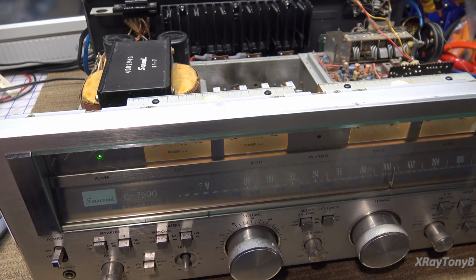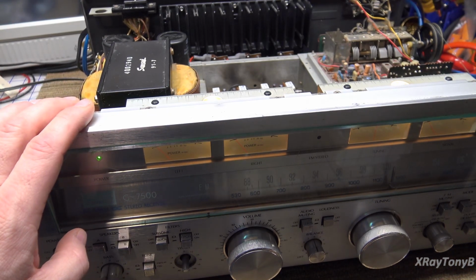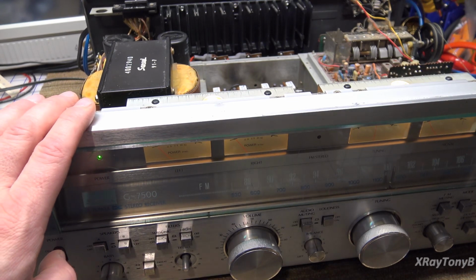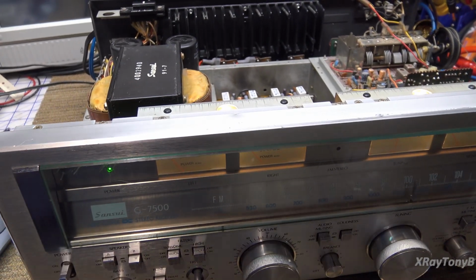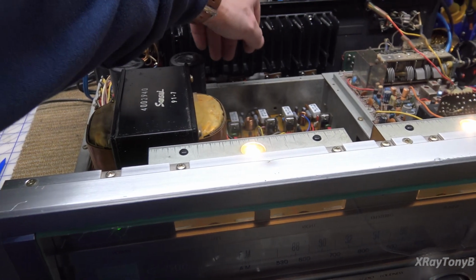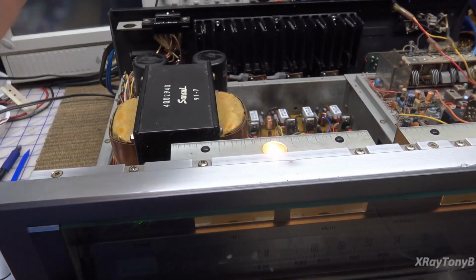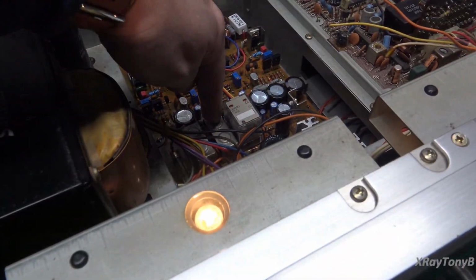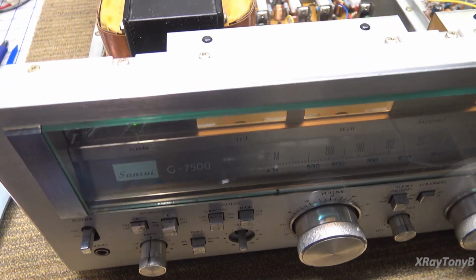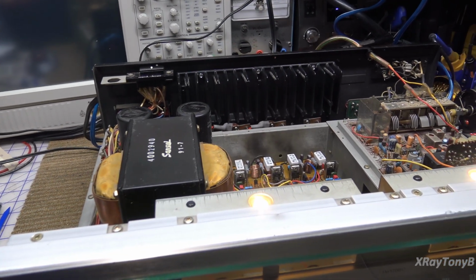So we're connected to speakers now, and I have the music player connected to the auxiliary jack, and I've been listening to this for some time now, and this thing is a floor shaker, let me tell you. I've been really blasting it to the point my wife came down and was like, what the hell? And throughout all of that, this heatsink's not even lukewarm. I have the whole heatsink assembled now and everything's properly aligned, and the power supply heatsinks are warm down here, and the main rectifier diodes are a little bit warm, but other than that, those are the only things that get warm. This amp stays really cool under really high power. And it's just ear-bleeding loud.